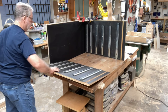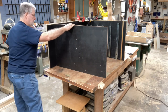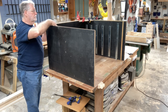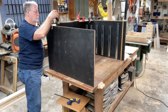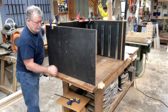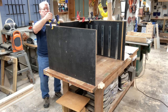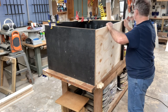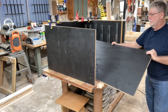Once this corner clamp is in place, I don't have to worry about it falling apart. I can simply move on to the next section and put up the other panel using the exact same technique — the right-angle jig with the clamps. That way I don't have to worry about the bottom panel falling out, and the whole cabinet will be together with my helping hands doing their job. After test-fitting everything and making sure the box all fits, I can take it apart, add the glue, and use the nail gun to put this together permanently.